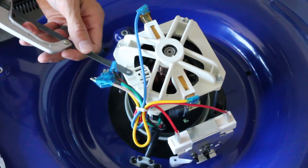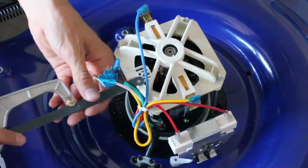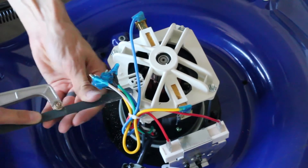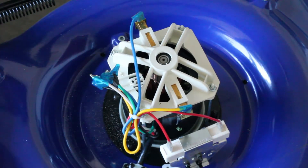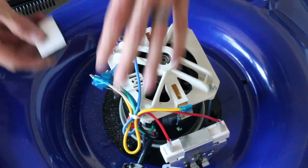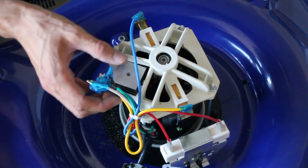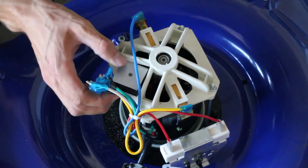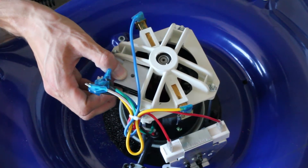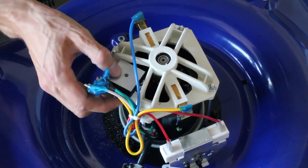It should be pretty amazing. I'm just going to cut off these little tabs here. That doesn't have to be flushed. I also have to be careful not to hit the commutator with the edge of the heat sink — I think it's going to be close. I'm spinning the motor from below, so I definitely don't want to hit that; I'll be careful.